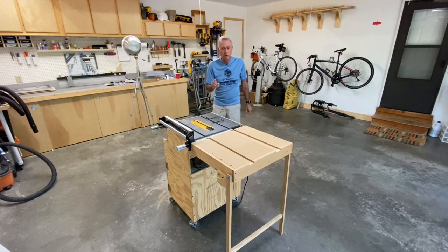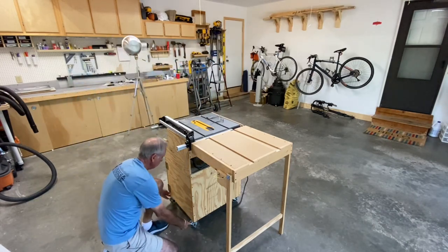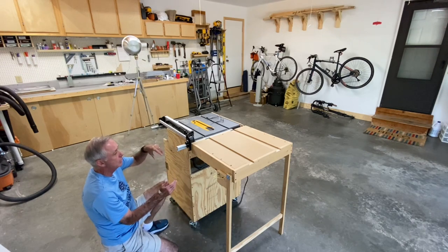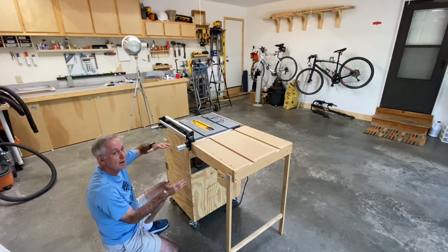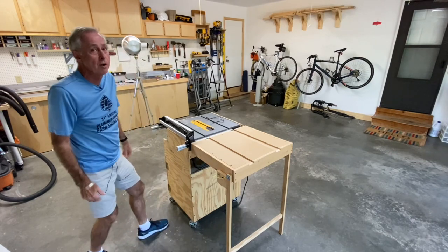The other thing I want to do is increase the length under here where I can put my wheels — I'm going to come out about 6 inches and then remount the wheels under there. What that will do is let me eliminate these legs and put a different style hinge in, and I won't have that tipping problem if it works the way I think it will.